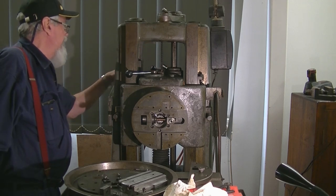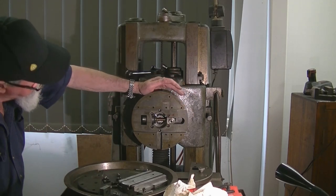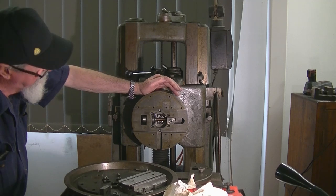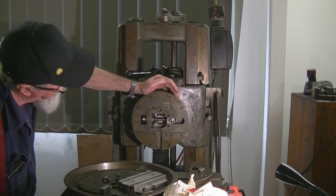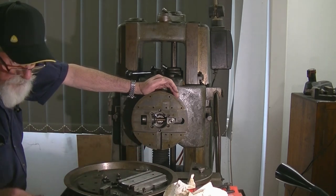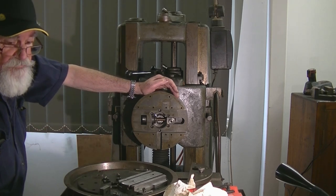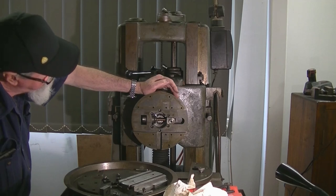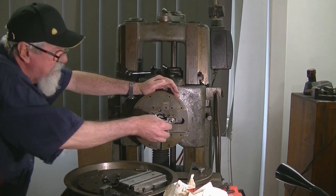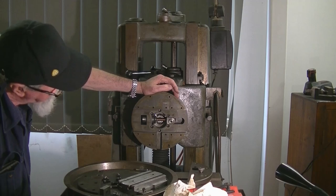There's an upper and lower feed and a little transverse shaft in the middle — I'll never be able to fully explain it. There's no way I can add or change the clearance that I know of. The plate with the slide can only go in one place where that groove is, so I can't have the plates back to front, and I can't have the slides back to front. I'm going to have to do a bit more measuring and see if there's something I've done wrong. It's got me stymied.